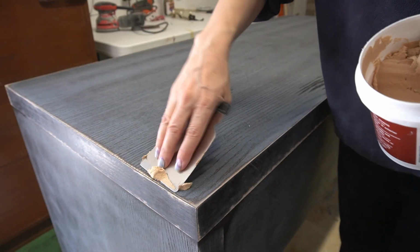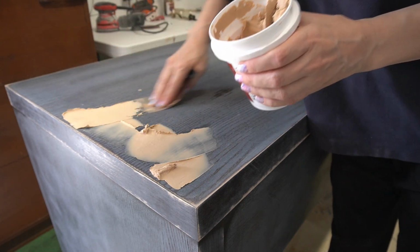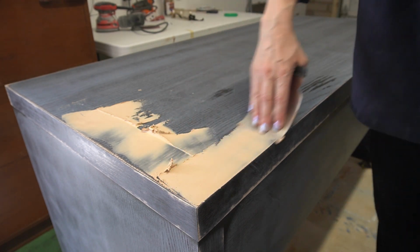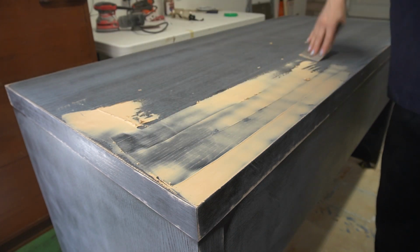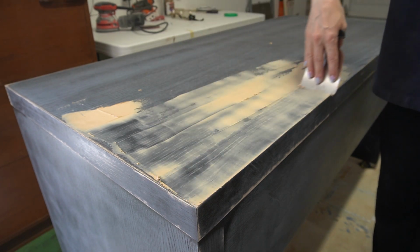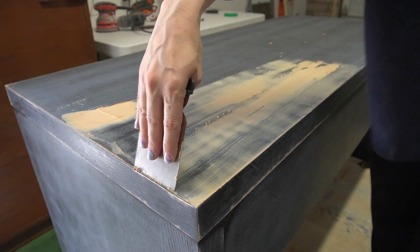I don't want the wood grain showing through on this piece once it's painted, so I'm using my Ace brand wood filler to skim coat the entire desk. As I was applying it with my trusty Japan scraper, I realized the fill was just a bit dried out. It was really hard to push into the grain and scrape it back without removing most of the wood fill. Kinda defeats the purpose.